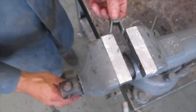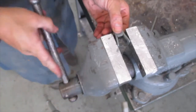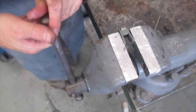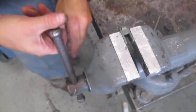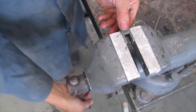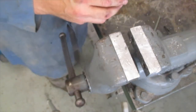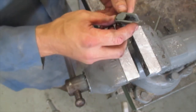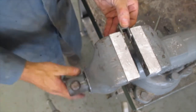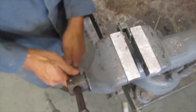According to the description on Do-All's website, the part is just made out of 10-gauge sheet metal, and it looked like it had been bent. So I just went ahead and put it in the vise and squished it back into its original form. I figured I didn't have anything to lose at this point, and I could always remake the part if I wasn't happy with the results. But overall, it straightened out easily and is restored to its original condition, and I'm ready to put it back on the machine.